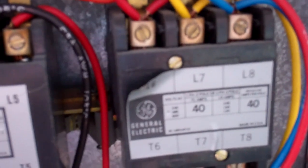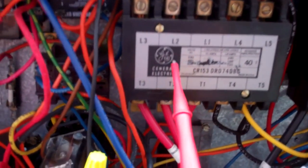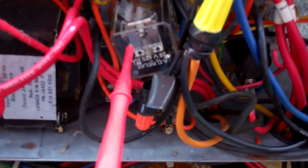The fan's just kicked in. I think as soon as the fan kicks in it puts power through onto the timer, and that counts down before it will put power onto either one of the contactors — low speed or high speed. And that's depending on what that relay does, whether it's on or off, because that switches between high and low speed.